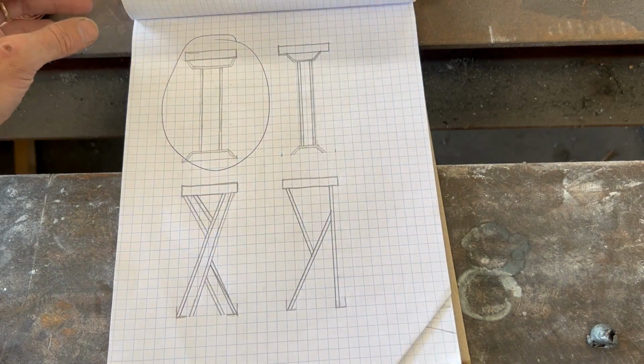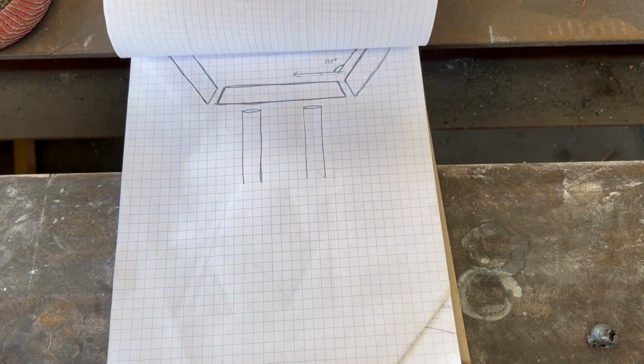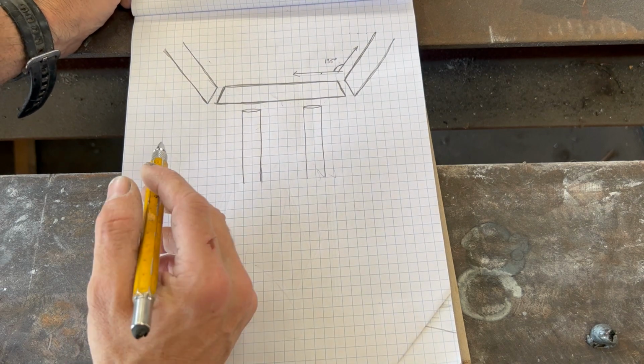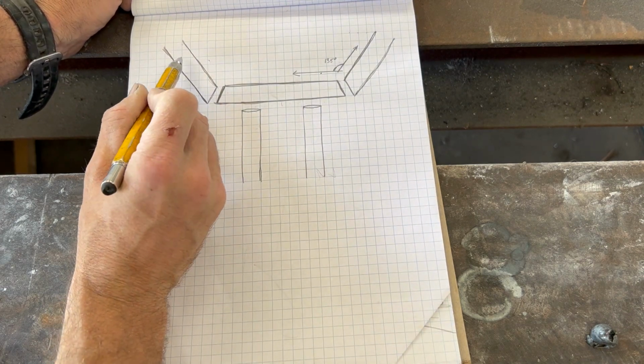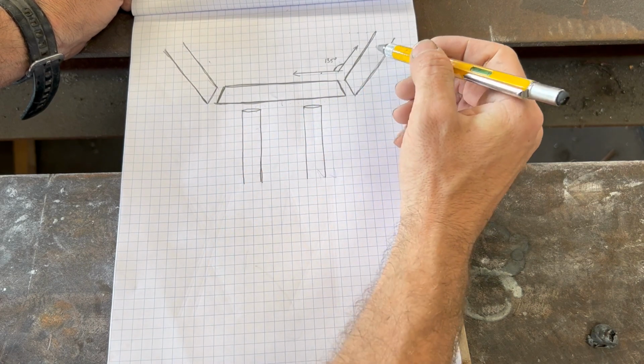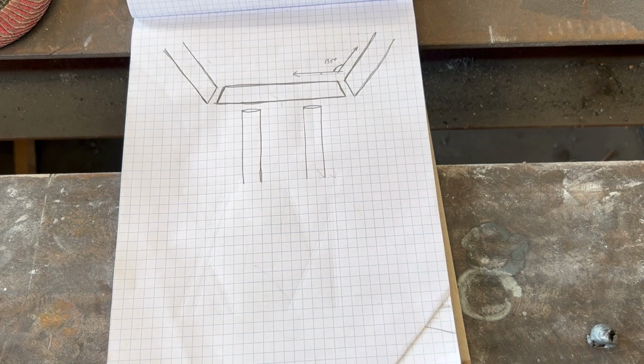I'm going to start off making these top and bottom pieces that got a 135-degree angle overall. So I'm going to start cutting some pieces with a 67-degree angle in them. I've got some 5/8 round bar that I'm using for this, so I'm gonna get to cut.